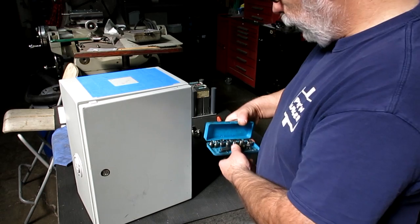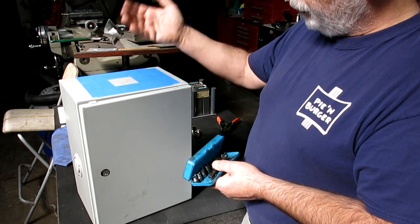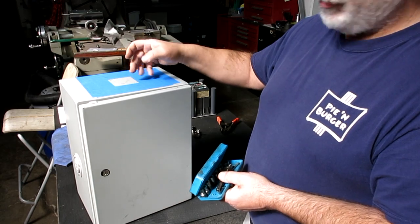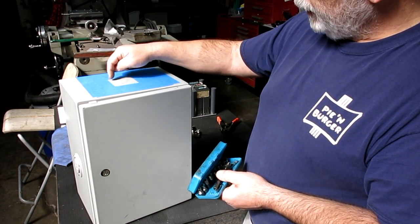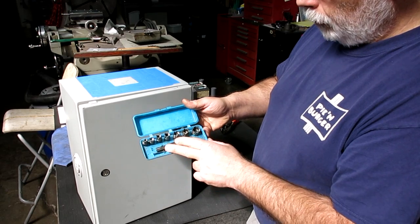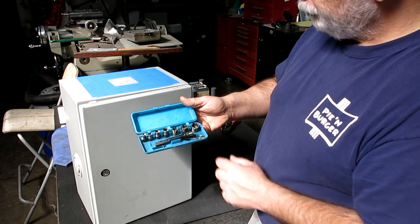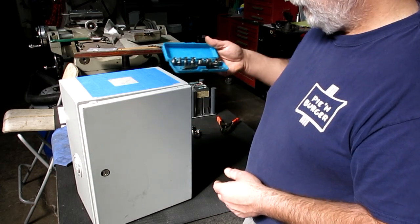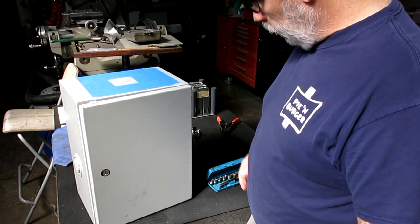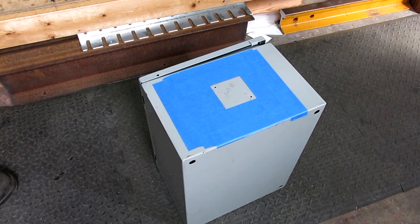So what I want to do is, I was going to mill this, but I said, yeah, screw that. So I'm just going to use a saber saw on it, but I need a couple of good starting holes in that. We're going to use the little Hougen rotor broach set to do that. So let me get you in closer, and then let me get a drill going and get an apron on, and we'll poke some holes with that. All right.